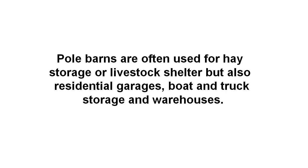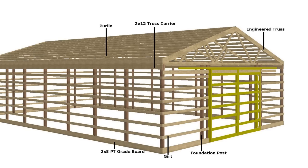The design of most pole barns is very simple. Poles make up the outer walls and support the roof system, which are usually pre-engineered wooden trusses with a metal roof sheathing. The poles are usually spaced eight feet apart, with the trusses bearing directly on the poles. Some variations in design call for truss-carrying beams between the posts with trusses sitting on them.